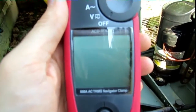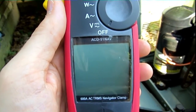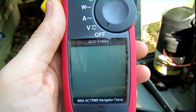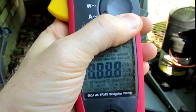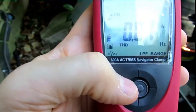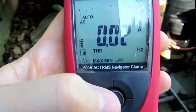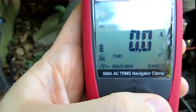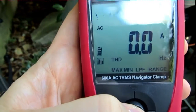Okay guys, because I've already kind of done this test before I started making the video, I know this compressor is probably going to pull more than 100 amps without the hard start or the 521. I had to figure out on my new amp probe that you have to change the range — see, that's inrush, but you go over here to range and change it so it moves the decimal over where it can read over 100 amps. Then go back to inrush, click it, and you're ready to go. I'm going to try the test button on the sure switch and see if it will start the unit.